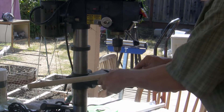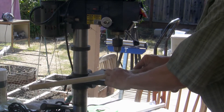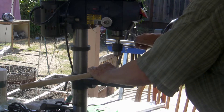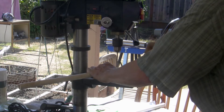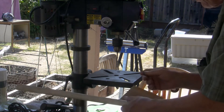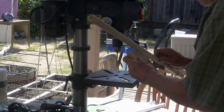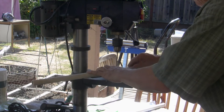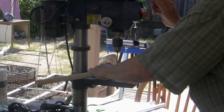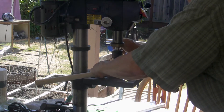I think I'm going to have the angle about like this, which should cover from here down and up there — almost what we need for an overhead pass. So we'll first drill that hole, then put the bolt through so we get the same angle on the other hole. I'm going to make this a little less than 45 degrees — probably on an overhead pass we won't have a big problem with that. Okay, so there's the other hole.